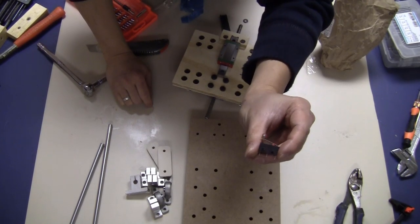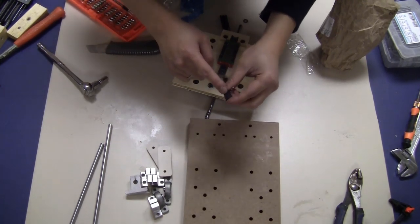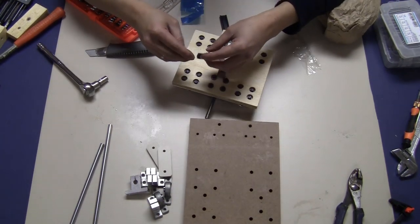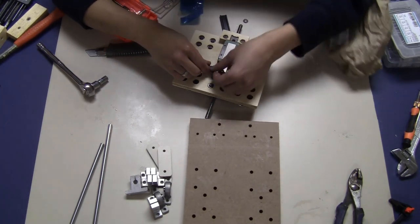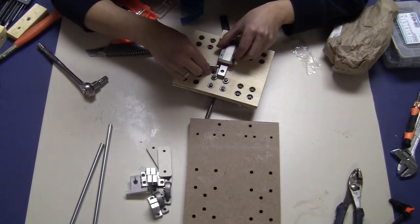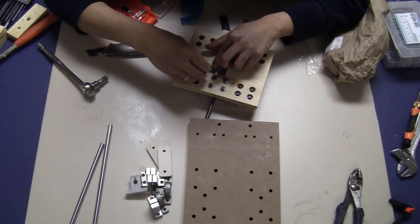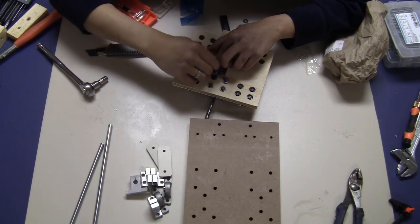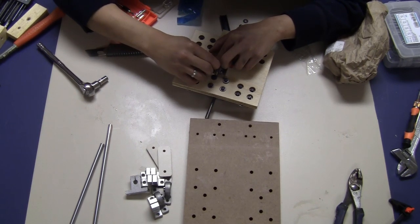This is the type of limit switch I'm going to install. I didn't pre-drill the hole because you might use a different type of limit switch. To mark the hole, I push the bearing block down and line it up so it's at the right place — when it moves up it will push the limit switch. I use a screwdriver tip, go through the hole, and push it down to make the mark so I can drill it through later.